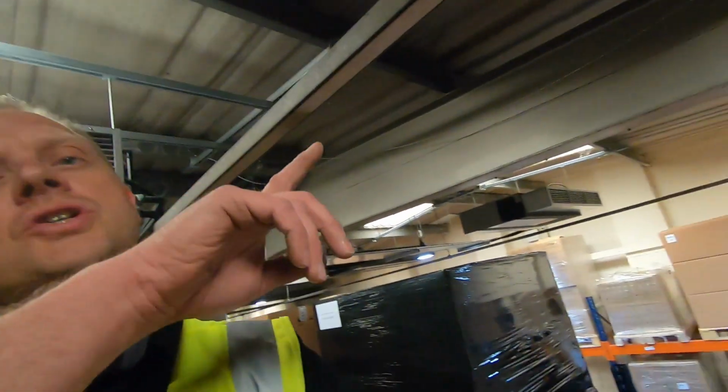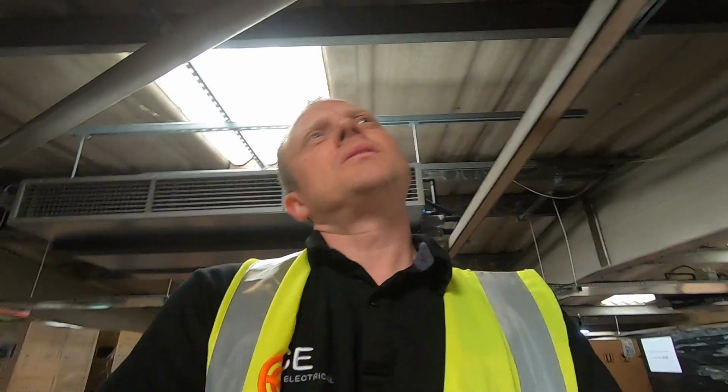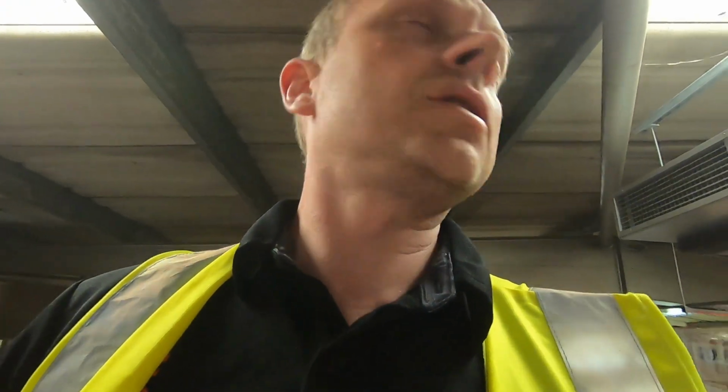because there still could be hidden costs. To be honest, what I didn't notice in this is that it's all singles inside this channel, but there's no earthing inside this, so it's the actual channel that's the earth. So I'm basically self-tapping too. They originally clamped around the nut up there, which, with some of these hangers, if you lift the trunking out, it comes off the purlin, so it's pointless. So I'm doing it to the channel, and I'll check at the other end that it's still connected.